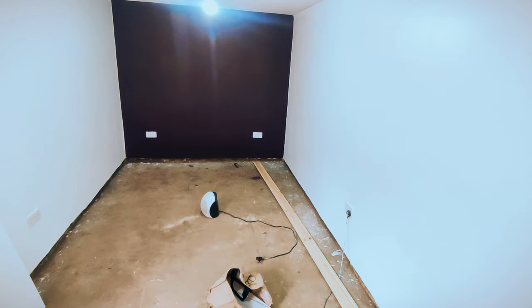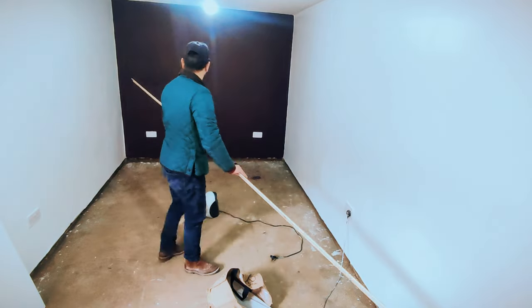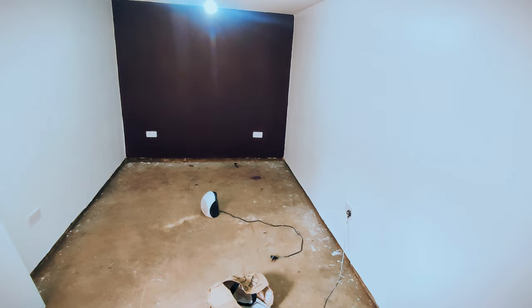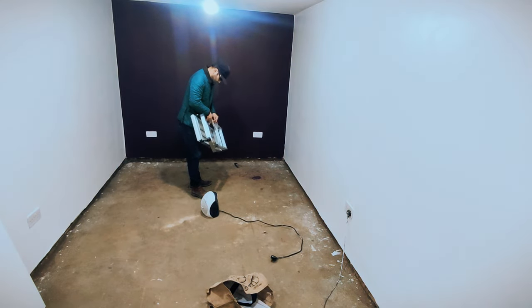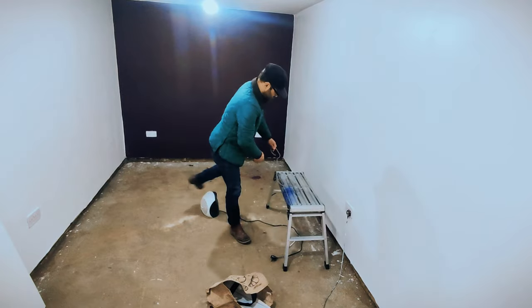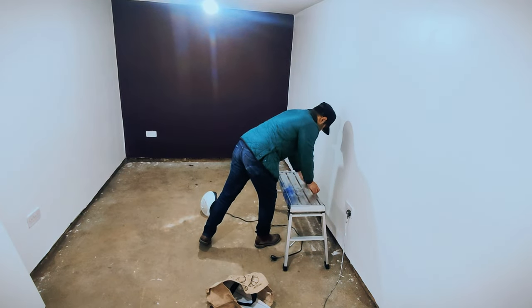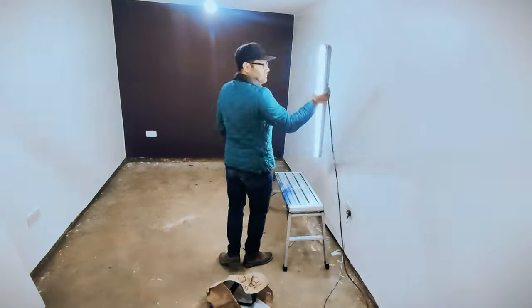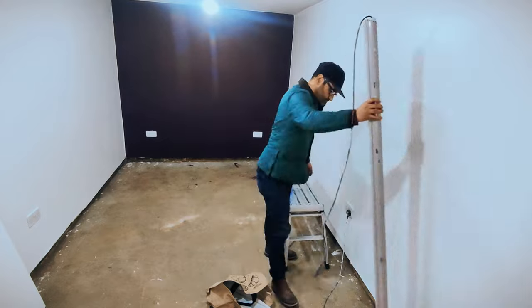So I pulled out the skirting and did all the painting and the floor before we put the skirting boards on the walls. If you buy skirting boards and you're doing a new room and you're going to have laminate flooring, do your laminate flooring first so you can leave the millimeter expansion gap around the floor under the plasterboard, because there's some space under there, rather than put it up against your skirting board, and then you have to buy special beads to hide the gaps around the wall separately. So if you're doing it this way, it's a better idea to do the skirting after you lay your floor. That's really what we did here.